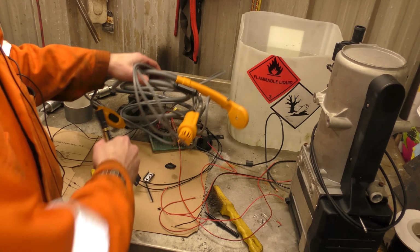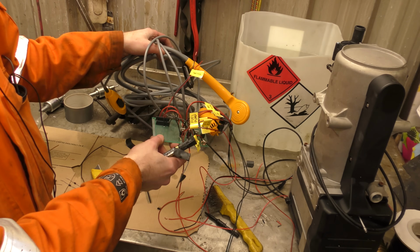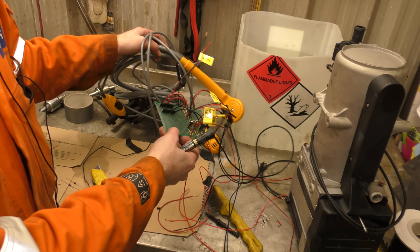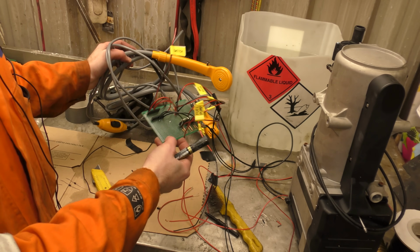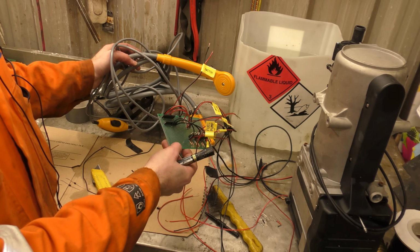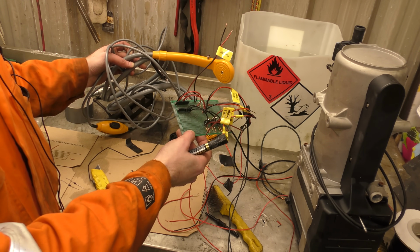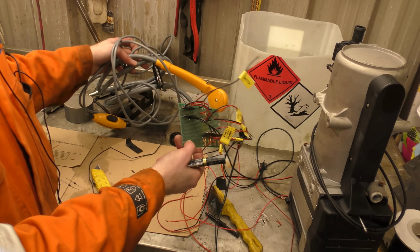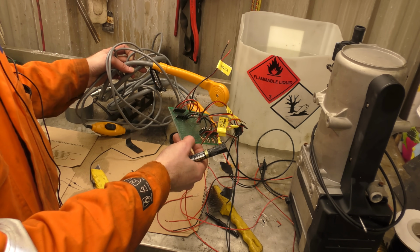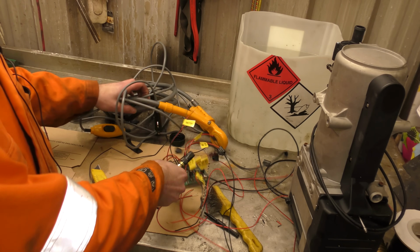I'm still trying to build our own Arduino-controlled ECU boards to run the Webasto and the pump, so that it can vary the pressure and the speed of the pump, so you get the temperature of water out that you want, and that would run from a tank. That would probably be okay because you're slowing the pump right down, so you're not using as much water. But again, we still need a safety system. The easiest and safest way would be to turn the fuel pump off when you run out of water, because then the heater just errors out and flames out and stops. Without actually running out of water and the thing overheating, you get scalded. You don't want any of that. You want it to cut the heat first before you run out of water.